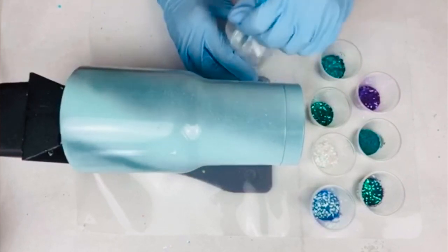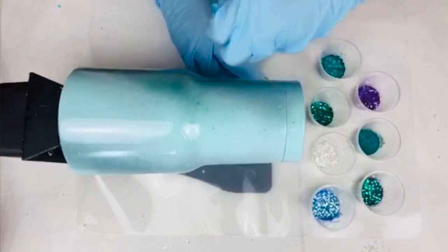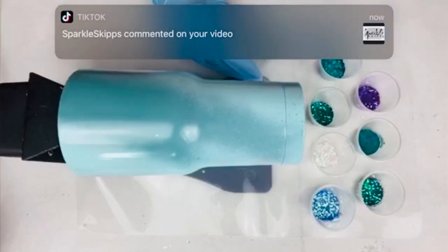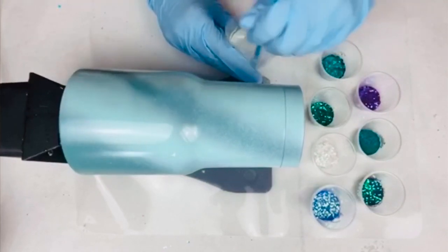You want to make sure you mix epoxy very, very thoroughly. You want to scrape the bottom of the container and along the outside edges. While you're working with epoxy, you want to make sure you're wearing your nitrile gloves, and you want to make sure you're wearing a chemical respirator. You want to keep your lungs safe.